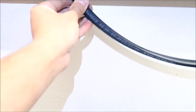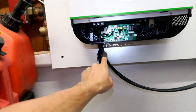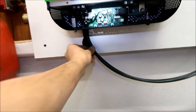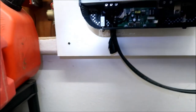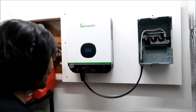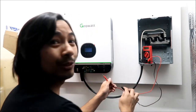It's fine — it's not going anywhere. I've got this big wire hanging out here. That was the AC output for the Growatt inverter, going from here to here. I'm going to put a clamp right here so this doesn't get pulled out accidentally — because you could easily trip and rip everything right out. I'm going to go do a quick continuity test just to see if I've got a good connection. I've got it set to ohms.